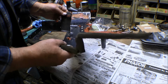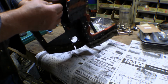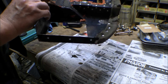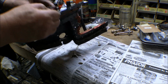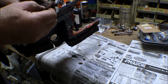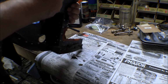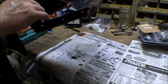And doing that, I did find this piece down here. It goes underneath the cylinder head portion, the fins. This portion that goes underneath the main cylinder fins is okay. But this piece here that goes underneath the cylinder head is pretty well sawed up in there from rubbing against the fins on the cylinder head, and it's also got a crack in it. Where's it at? Oh, right here. I probably should go ahead and do some repairs on that.